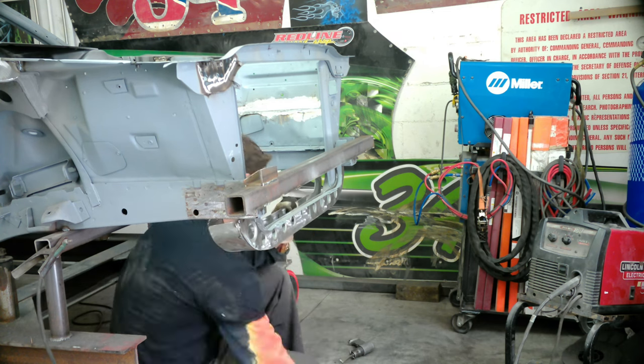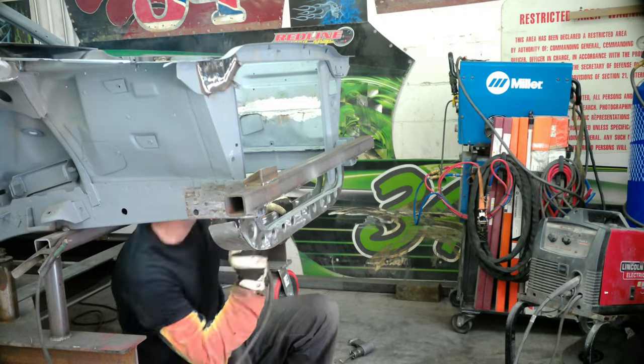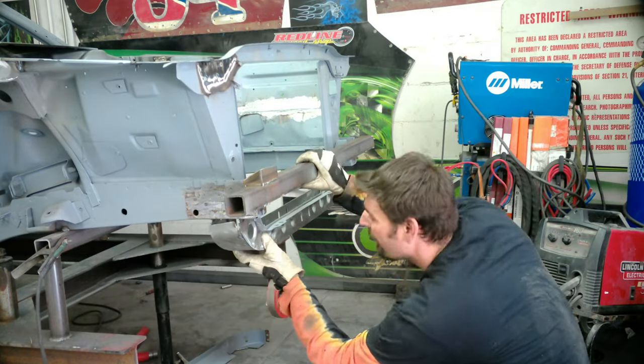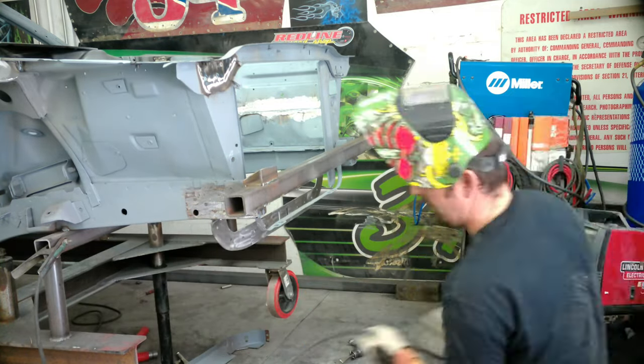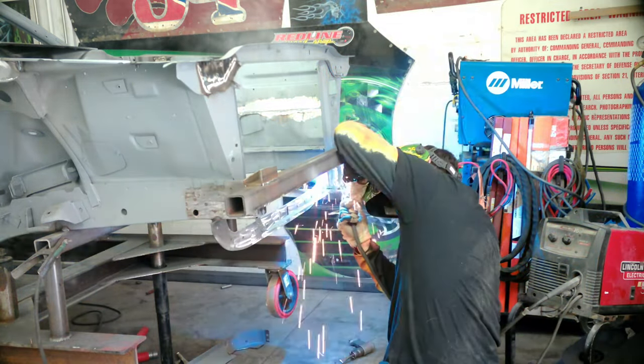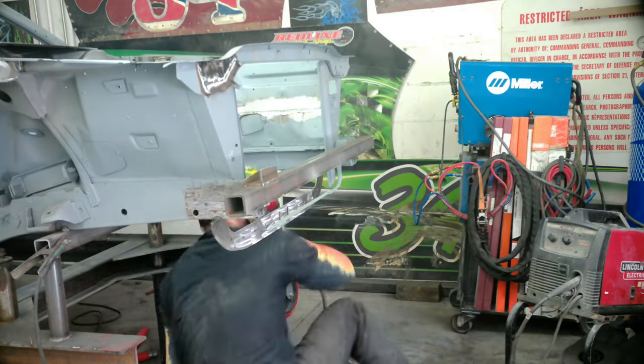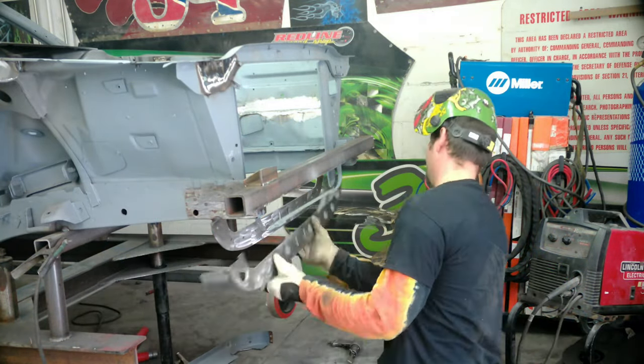The back looks like it welds underneath, in the middle of the front one. So what I'm going to do is tack the back one as a reference, pull the front one off here, and weld in the back completely. And then in a second, we'll put the front one back on and get that one also welded in completely.